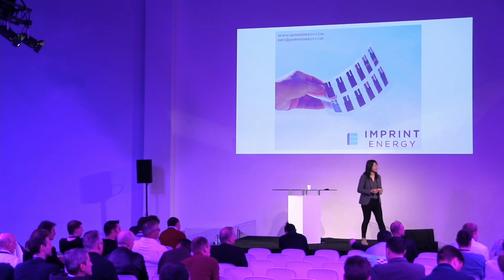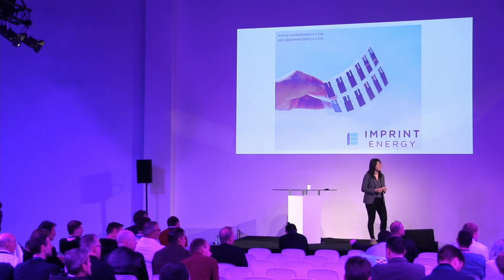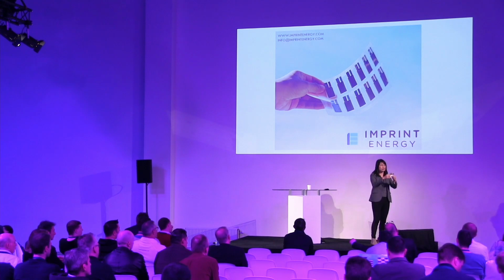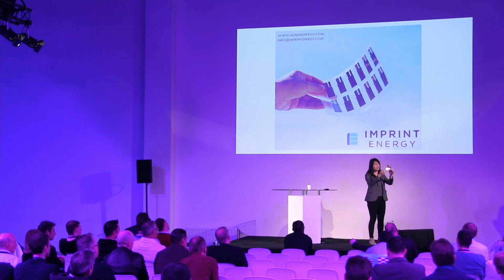Another question here. So what's the actual capacity of the battery in milliampere hours? For example, that one that you're holding. So this is a credit card size pack. There's actually 2 cells in series. So a single cell is 50 milliamp hours. And why we have 2 cells is this system needed 3 volts as a starting point. But bigger battery, bigger capacity, smaller battery, smaller capacity, and that's fairly linear. That's just like sort of an area computation.